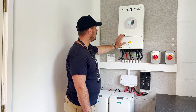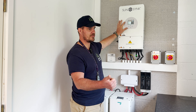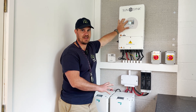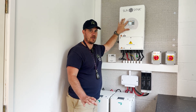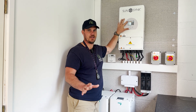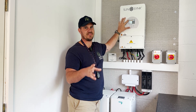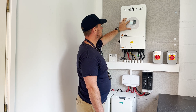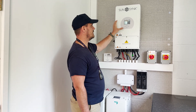So it's been fully reset. Note that the DC icon is solely for solar — it's nothing to do with the battery, even though the battery is DC. So don't be alarmed when you turn the batteries on and the DC light is off, because the DC light only identifies the panels and the PV. So now we've got DC on, AC on, and the normal light is on — that's telling us everything is normal. We don't have an alarm light.